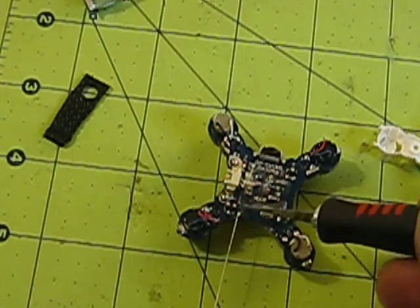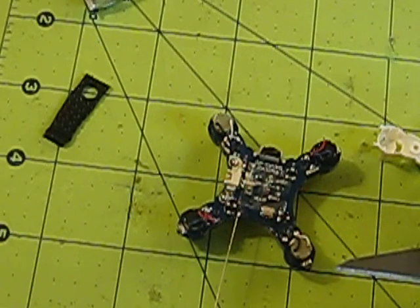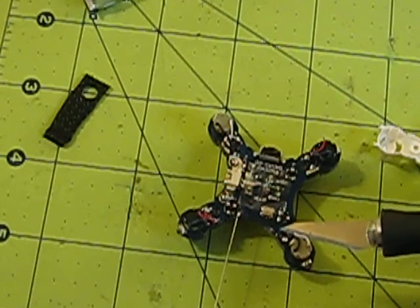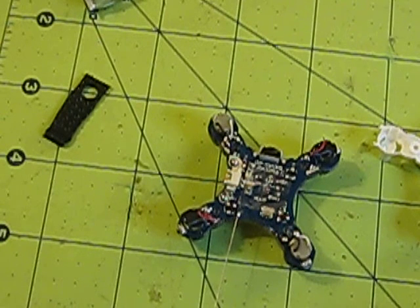Following Sirius Flyer on RCG, he said he cut the trace and is just running the wire only. On the last one I did, which was a HY-51, that was successful — I left the trace connected and just put it on. I thought I'd just follow what Sirius did and cut the trace and just run the wire straight to the receiver.